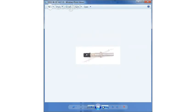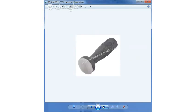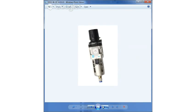Something right after the air compressor is the filter regulator. This is a picture of a filter and regulator built in one. The bottom of it is a screening device where it takes particles and moisture out of the air coming out of the compressor. Because when the compressor runs, it makes it hot. When it goes into the tank, it cools off rapidly and gets a lot of water in it, if you're in a humid place like we are anyway. And so this water will drip out of the bottom when you release it out of this particular regulator.